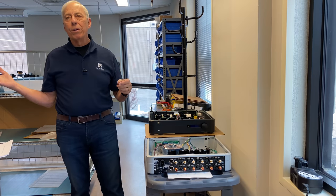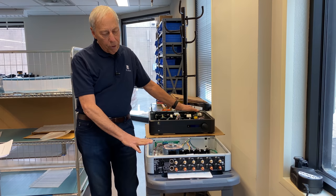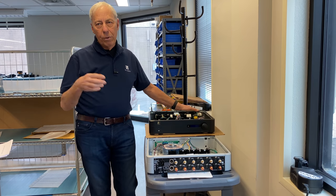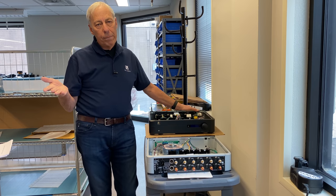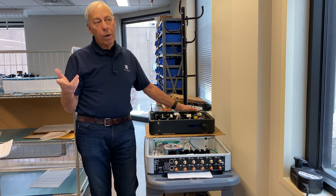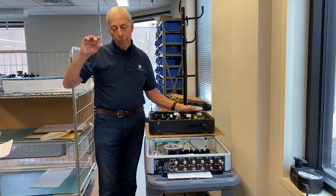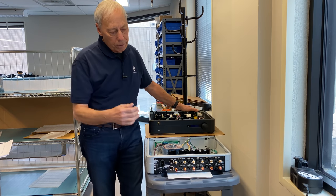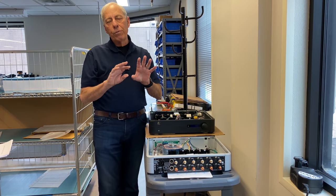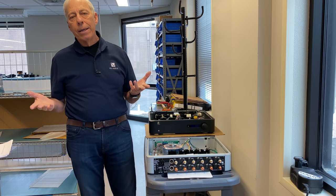Now, we use shorting plugs here all the time because when we're measuring a piece of equipment for noise, we'll want to short out the inputs so it's not picking up any crap, right? And the difference between measuring noise with the input shorted or unshorted is a number of dB. I mean, it's clearly visible on the Audio Precision test equipment or on a scope. Real easy. You always want to use shorting plugs when you're trying to measure the actual noise from a circuit without adding something to the input, okay? And so that's sort of the idea of what people do.